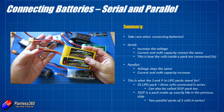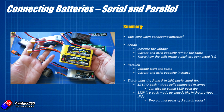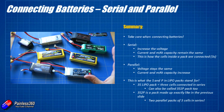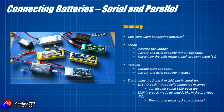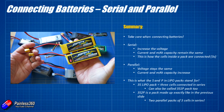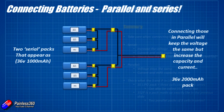That's also handy if you want to charge multiple packs together. One last tip — this hopefully explains where some of the nomenclature comes from for batteries. The S and P you'll see written down occasionally and it can be very confusing. The S stands for serial, so if you have a 12 volt 3S LiPo pack, the S stands for serially connected. You can also see it written as 3S1P — three batteries connected in series. You can also get 3S2P packs — that is three lots of batteries connected in series and two of those connected in parallel, which is exactly what I just described.